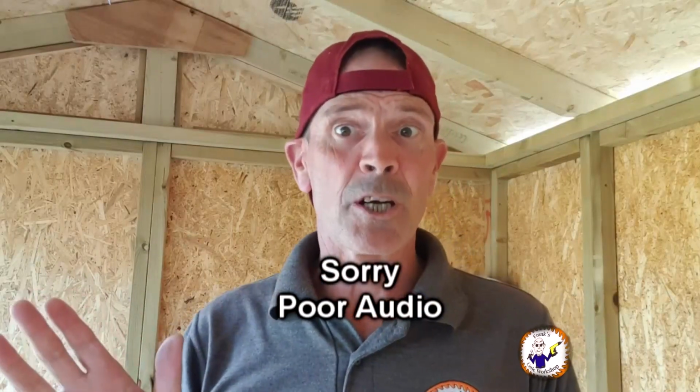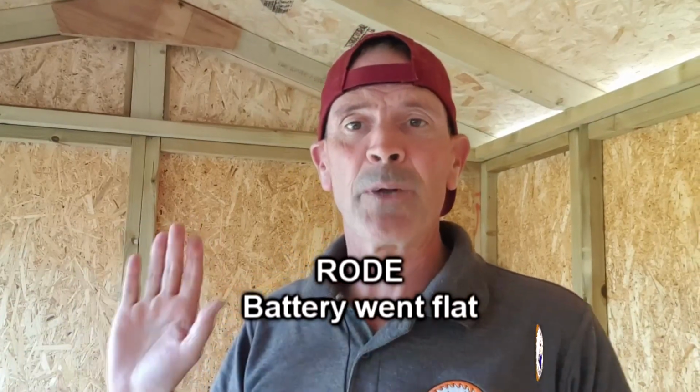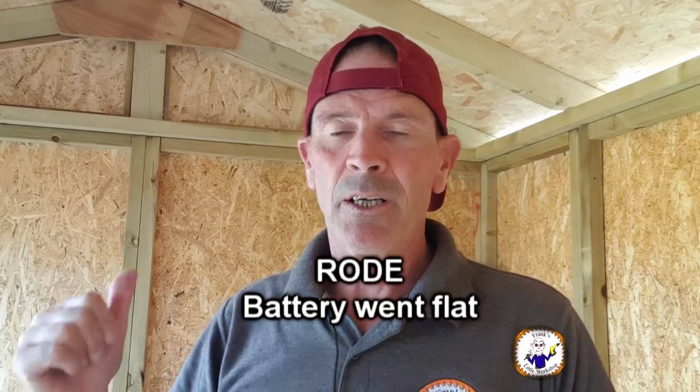So it looks like the corners are going to work quite well. What we've got to do now is start putting some cladding on. I'm going to do the side first. I've measured up and I've cut the lengths. Now, obviously the most critical part is the first piece of cladding you put on. That's got to be dead level. So what I'm going to do is space that out, put that on. I want it about 7 mil off the floor so it doesn't soak up any water.